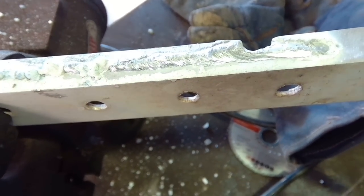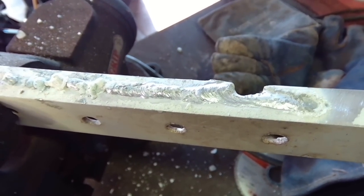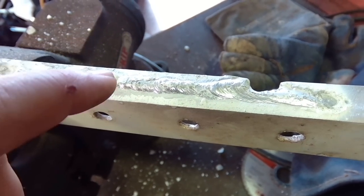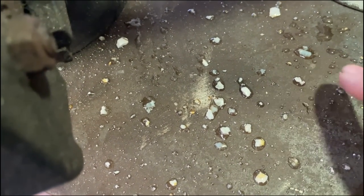The pride in my longest run so far was very short-lived because the heat built up and it burnt through. I can drop the amps, but it's made me realise it really is just a case of practice because you move so fast — the whole rod is gone in 10 seconds. Once you get used to that and can sustain an arc, otherwise I find the gap gets too big and I'm losing the arc. Next step is to practice the right technique — moving really quickly but with lower amps — or do just short sections and let it cool while working on the real job. The slag is funny too — it's all got moisture around it, every drop has a little puddle around it, it's obviously very absorbent.